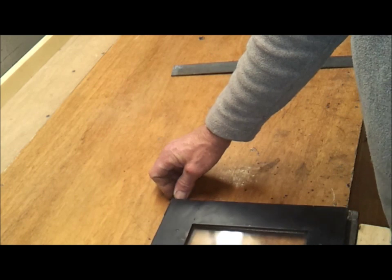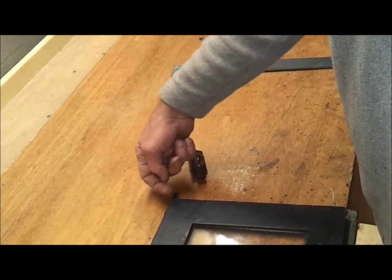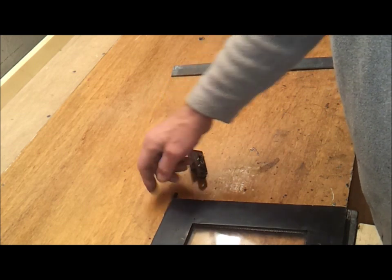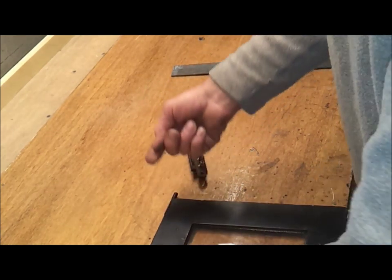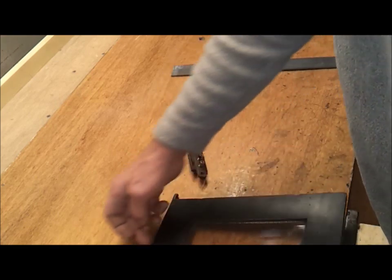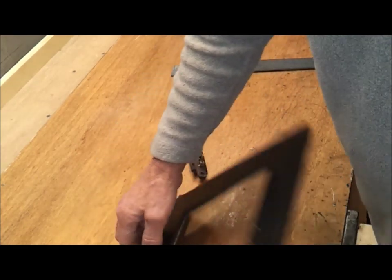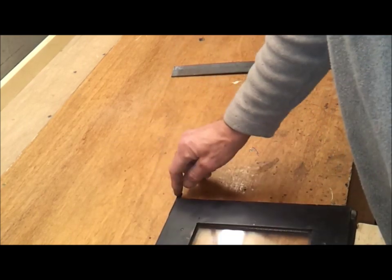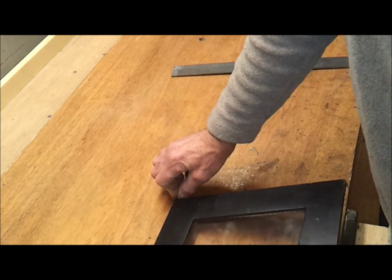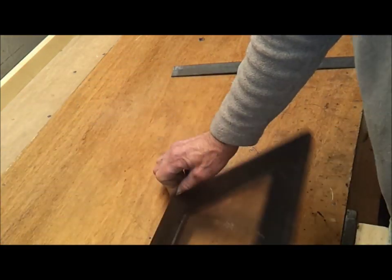But the hinge pins ideally should be virtually at the bottom of the box, not at the top, because if you put the pins higher up, it's going to have a cantilever effect, and it's going to make the bottom edge drag. So the lower it is, that's the, what do you call it, the hinge point. It will just rotate off that lower point there.